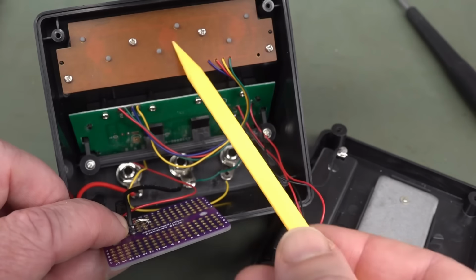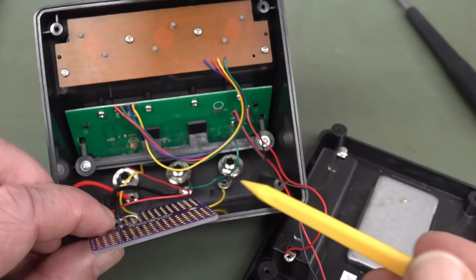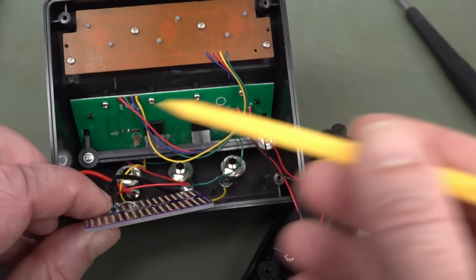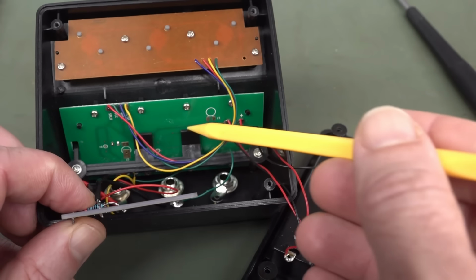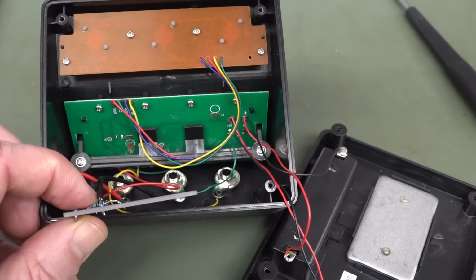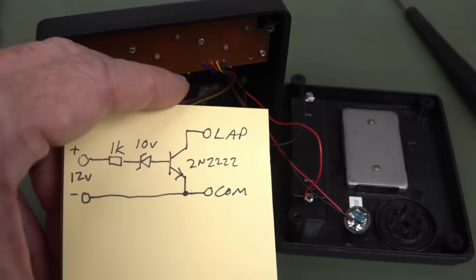Just the front panel key switch board, with discrete wiring going over. So they haven't production optimized this thing at all. And we've got our three terminals down there, and just a single PCB here. I won't bother taking it out now, but I've taken it out donkeys years ago. From memory, there's just a little chip on board, a single custom ASIC chip and just a blob, driving the LCD. So pretty simple. I've created the mod board here with the circuit exactly as configured there.